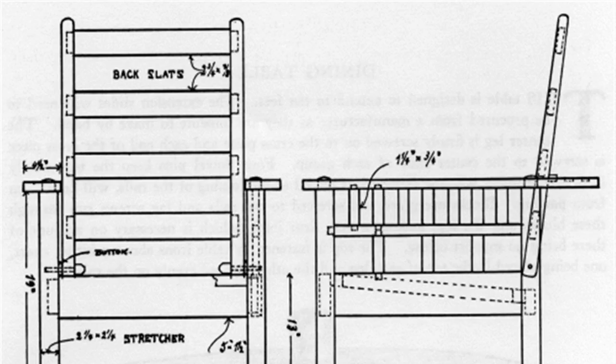Stand your side up and attach the arm. It will hang over the inside edge — the edge where the slats and rail are flush — by 1/2 inch. It will hang over the outside edge 2 inches. It will hang over the front edge 2 inches and over the back 5 inches. Finally, center and attach a corbel to each leg so that it is flush with the bottom of the arm. See image for your finished side. Repeat with a mirrored version for the other side.